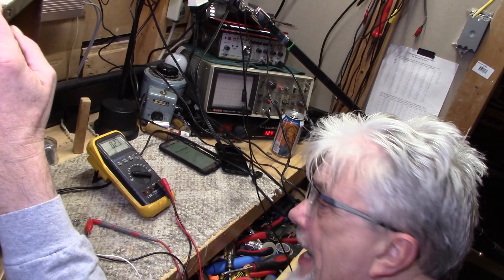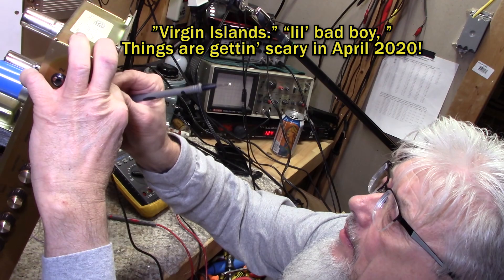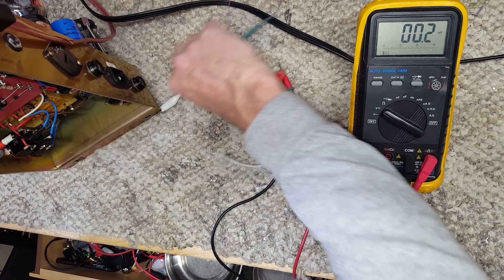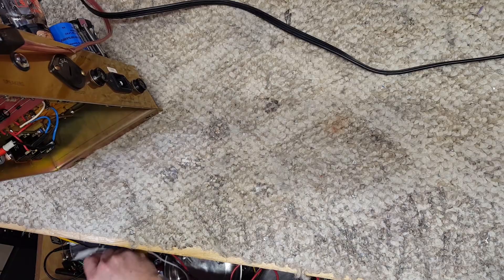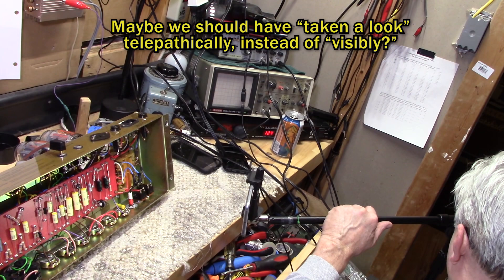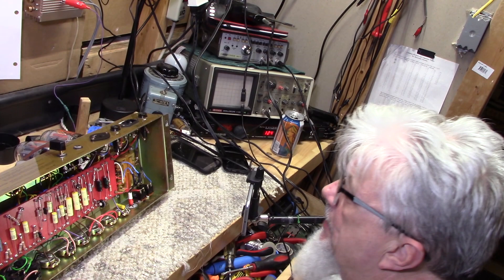Well, there you have it — he has the tube retainers but it didn't hum before. We'll find out what it is. The power's drained out of the capacitors, we don't have to worry about that. Let's take a look visually and see if we can find out why this is having problems. We're going to verify the output transformer and all the connections to the tube sockets, because there's something going on between these two tubes that's not balanced.